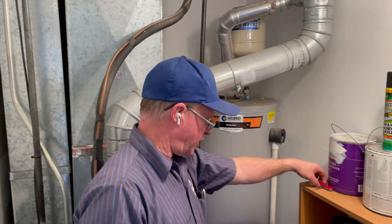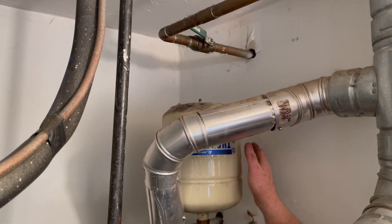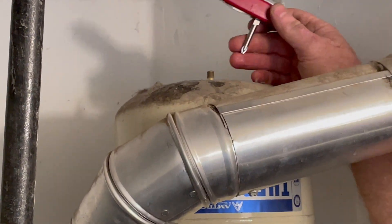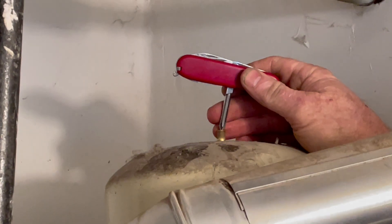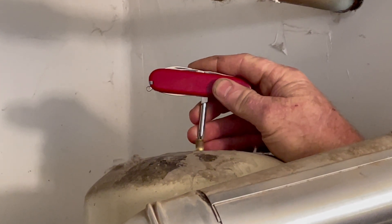The first thing you can do to check this is you give it a tap and it's very solid — it's like it's full of water, like a watermelon instead of a hollow sound. The other thing you can do is you can push on this air inlet or outlet and see if it's got water in it.